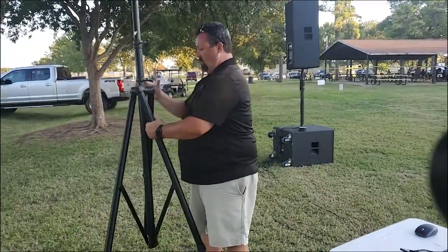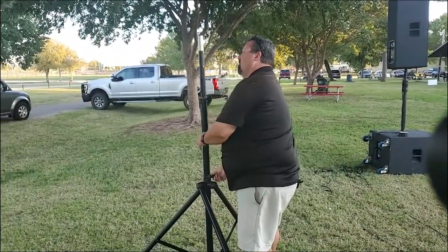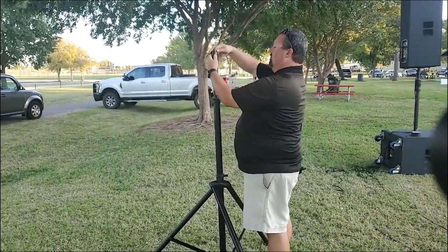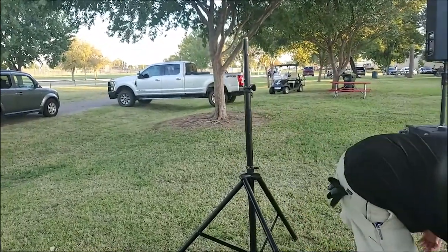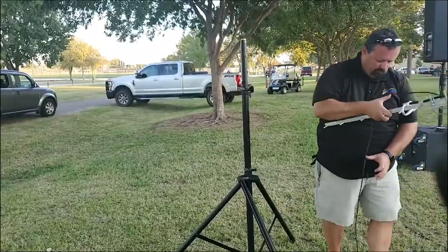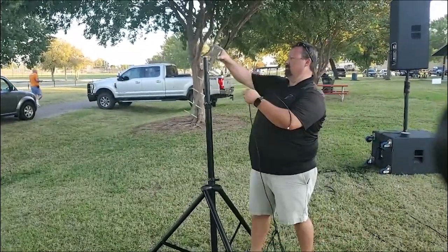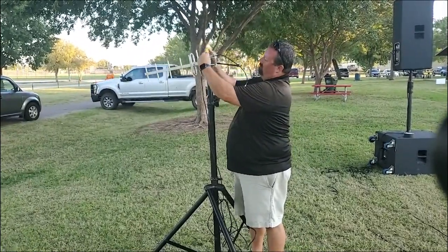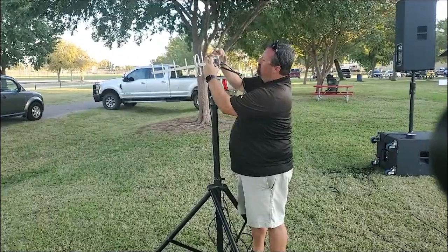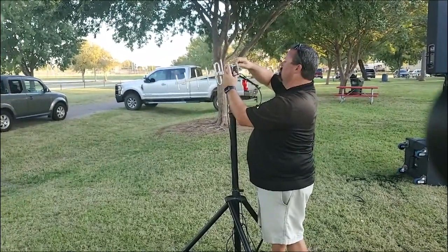For professional shows, we often use an antenna stand with a Yagi antenna. Here you're seeing the Yagi setup. Yagis are not expensive. They're about $50 to $70. But they give a directional signal, which gets you straight out to the modules without having to have any intervening mesh network modules or anything like that. You could get over a mile with a good Yagi antenna.